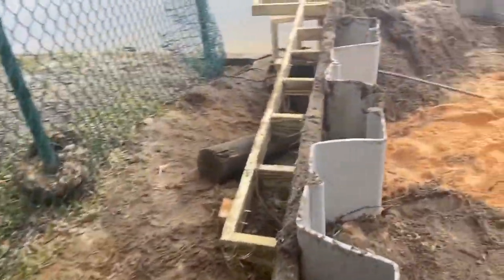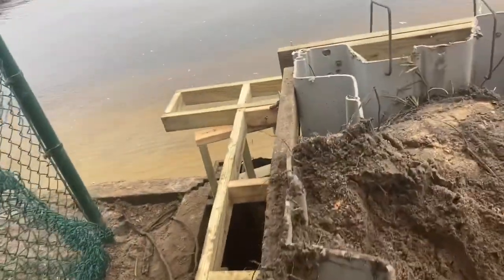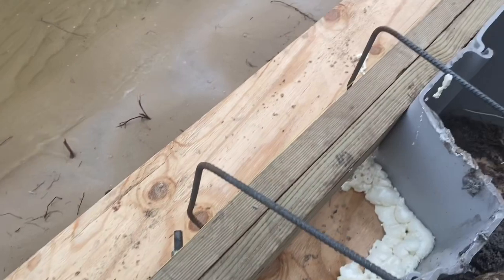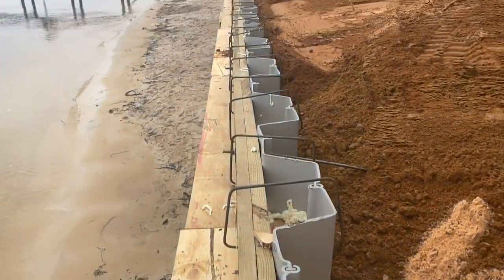This is our forming material that we put underneath the three-quarter plywood. We've got two-by-fours on one-foot centers, then we lay the three-quarter plywood on top of it. You can see here the rebar that I mentioned earlier — it's on one-foot-six-inch centers. We'll take four rebars to tie that out also.